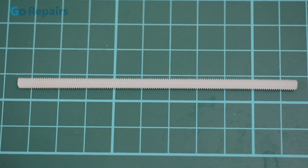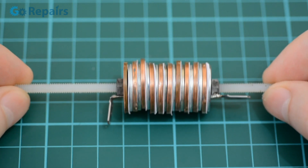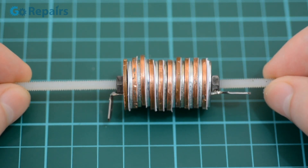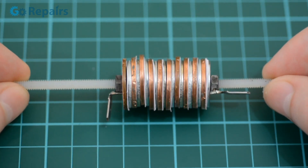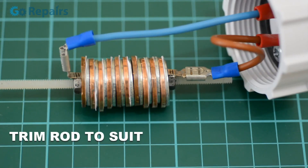Now, taking a threaded nylon rod, we're going to make our battery cell shish kebab. First place our connecting nut on the rod, then we can start stacking the cells as shown previously, ensuring our paper washers are damp with electrolyte. When you've stacked all your cells together — in my case 10 — then add the other connector nut to lock things into place.